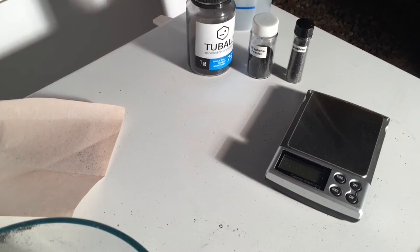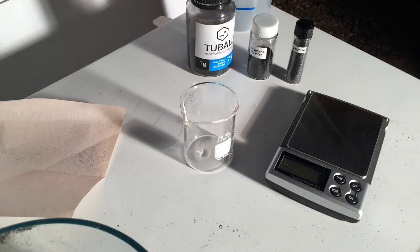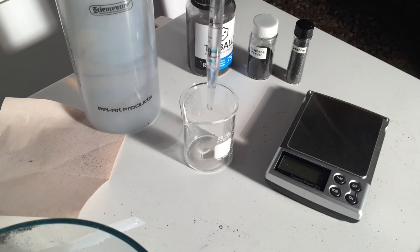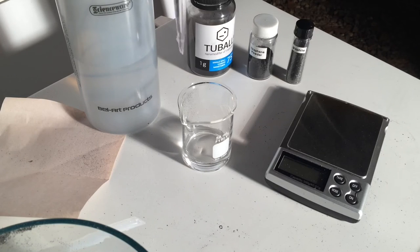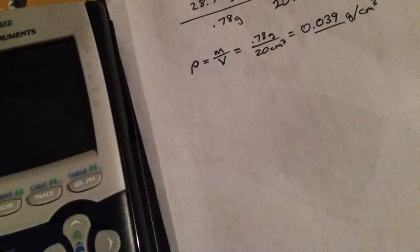It reads about 20 exactly. Sometimes they print the labels on these beakers and they're a little off — this one says it's about 5% off, so I've got to verify how accurate it is in order to see if that 20 milliliters is good for this calculation. I'm going to carefully measure in 20 milliliters of water using a long graduated pipette, so I can accurately pour in the amount of water to see if it's accurate or not. Put in the first 10 milliliters, then the remaining 10 milliliters. You have to look at this very level. It's exactly right on.